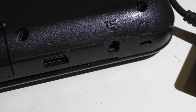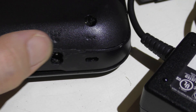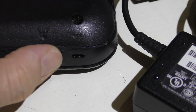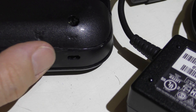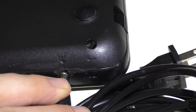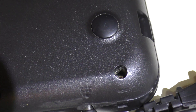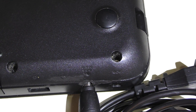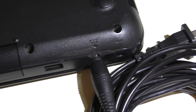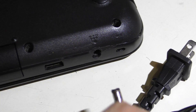Well, tomorrow is today. We're back with the repair job from yesterday. You can see the Sugru is all nice and rubberized over here, which is exactly what I wanted. This just neatens the hole up a little bit and takes off those rough edges that were all chowdered up from the previous damage. I also did the end of the wire — you can see it's nicely rounded out, not missing that little piece anymore. And of course the final test is to plug it in and make sure it works. Bada bing — looks good to me. The screw I put in there is holding the case together nicely. That should keep the case from opening up and hopefully the charger won't fall out again. It's pretty strong — there's some wobble, but that's just the nature of the jack. I'm pretty confident this is going to hold up nicely.